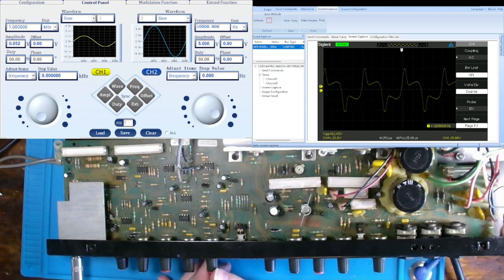Now, if I increase the sub after making that lead change, here's where my focus is at. If I increase the lead, you see that still takes us back to that square wave. Now if I change the sub, you see we're getting a bit more low frequency roll off. Anyhow, just wanted to show you this so you can see what channel A does. Our boosts were relatively close, just a little shy. So I think we'll call channel A good as well.